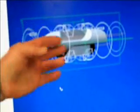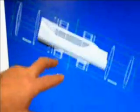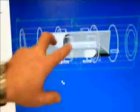So that's the suction, essentially. Yeah, it's actually suction's coming in through this end, up through two ports there on the other side. They're coming in the other two, and then they're being forced out on the opposite side. If we had 3 lobes, we'd need 3 sets of these. In this case we just have 2, 1 set per lobe.